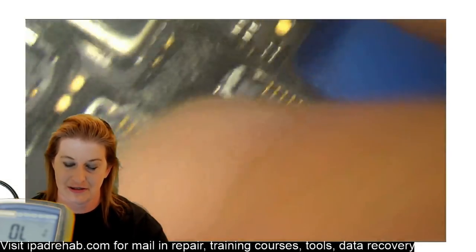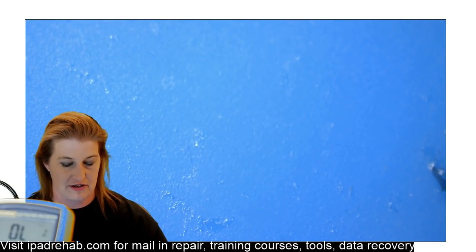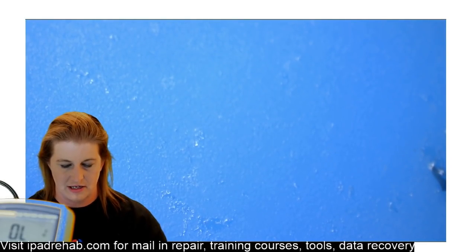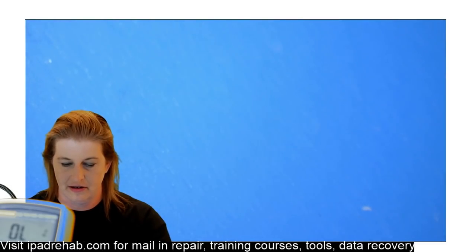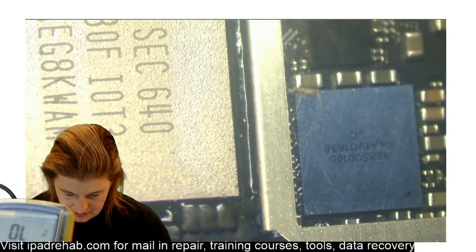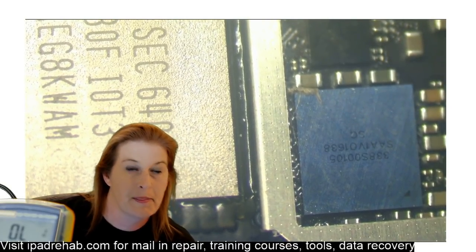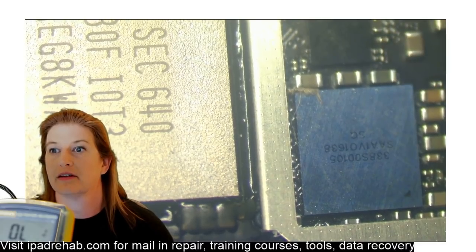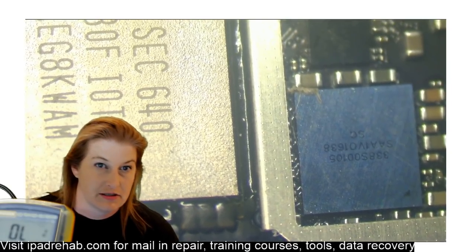We took the filter off and laid a wire for troubleshooting. The advantage of diode mode versus just resistance is partly about speaking the same language as everyone else — ZXW uses it, the community uses it. Resistance is technically a better number, but diode mode with red probe on ground is the accepted standard. There's also a relative tolerance between different meters, but as long as you're consistent and comparing within the same meter, the method works.